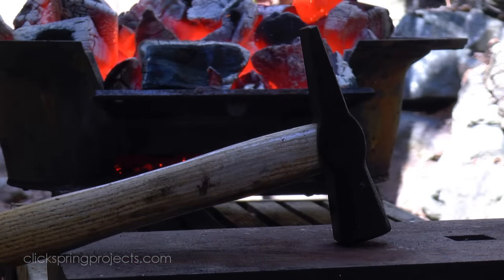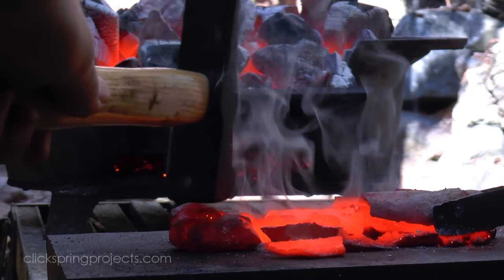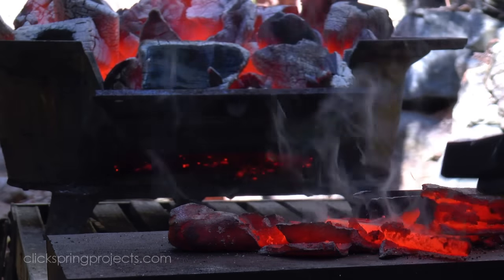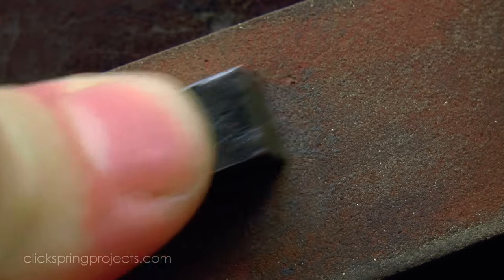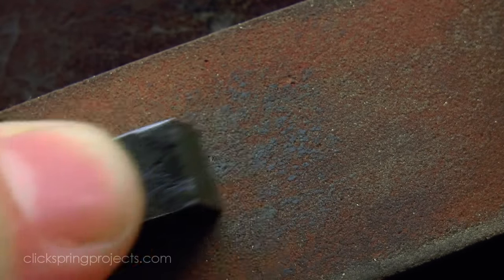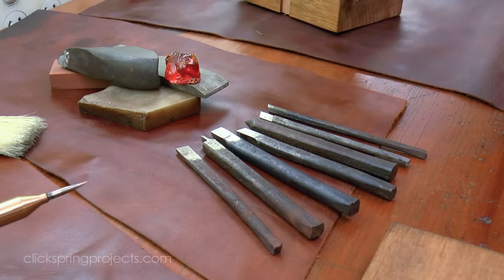The cutting tools are another example of the carburized iron cutting tools that I've been using at various points in the construction of the mechanism. Each lathe cutter has been forged and then carburized using the leather charcoal and salt carbon pack described in a previous video. Once tempered, the cutting edges are brought up and then continuously maintained as the work progresses using abrasive stones.